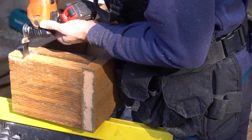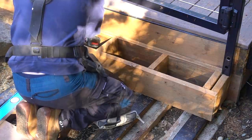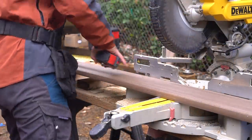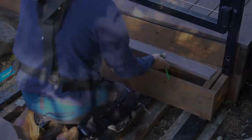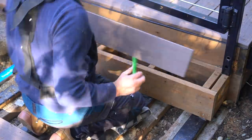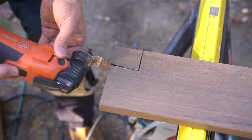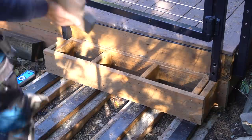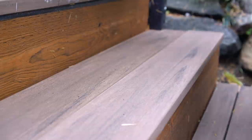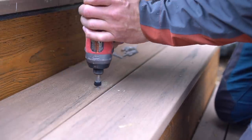I notch out the appropriate mount with my multi-tool, which makes quick work of any notching needs. After positioning it correctly and level, I secure it to the deck with a few exterior screws. For the decking, we're using the same material as previous videos — TimberTech Vintage Collection in English Walnut. I notch out a small section on both sides of the stair tread so it fits snugly against the deck, use deck spacers for even spacing, and secure the boards with Cortex fasteners.